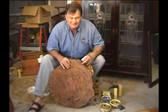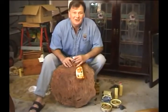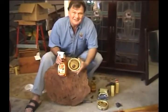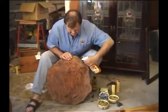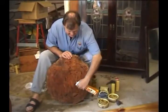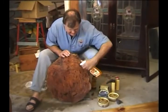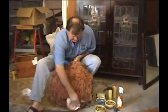This is a piece of timber from the forest — a piece of gum. I'm going to make it look so much better by using orange oil, and this time I'm going to be using citrus shield as well. This is the citrus shield, and this is our range of coloured waxes — they're fabulous. Now, how do I treat this gum? First of all, I give it a drink with orange oil — a drink and a clean. I put as much orange oil as I can into it and allow it to penetrate into all those little bits and pieces, down into those little cavities. I give it a good go of orange oil and let it sink in there, maybe even for an hour or so. Just let it sink into the wood. Then I come back when I'm ready and just take the excess off.